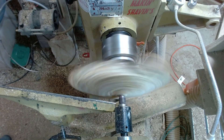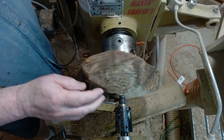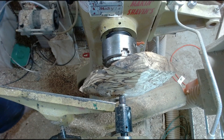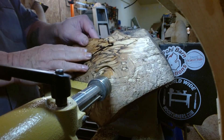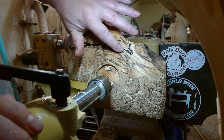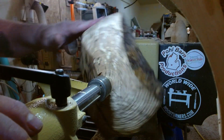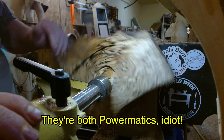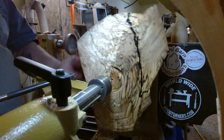I didn't want that to happen. Let me see if I can find it and if it's salvageable I'll come back. I've got this glued back together — I used wood glue and then filled the crack with black CA because it should almost mimic the black spot lines in this spalted maple. I came over to this lathe because the other one is busy, and I'm going to get my face shield on and get my tool and see what we can do.